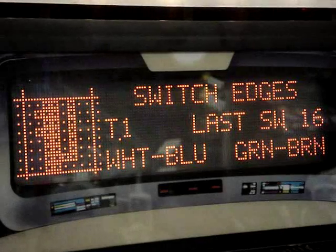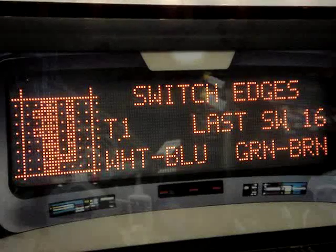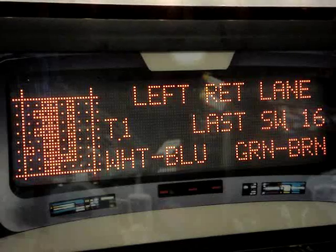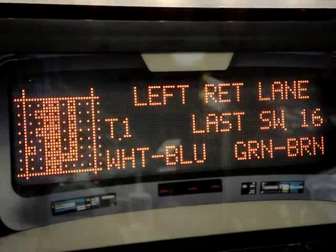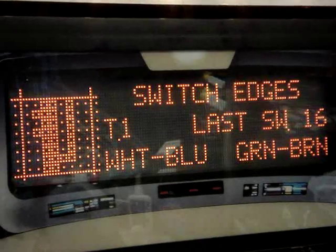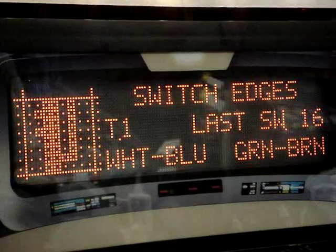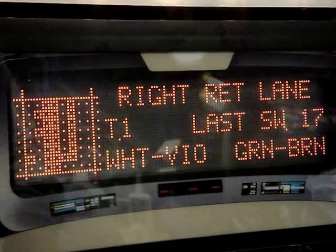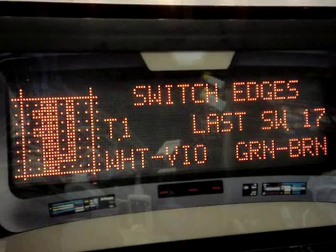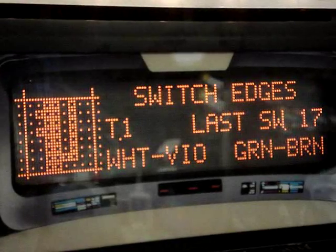Let me take a ball and put it in the left eddy switch. There it is — the left return lane. As I move the ball past the switch, the switch is engaged, and now it's not. Let's try the right one. There's the right return lane — now it's off, now it's on. Both eddy switches on the return lanes are working.